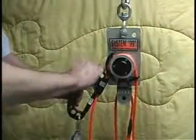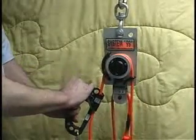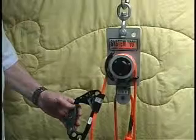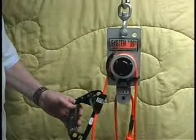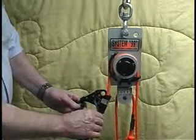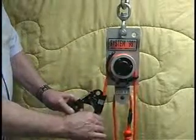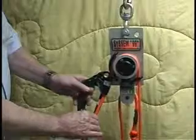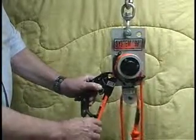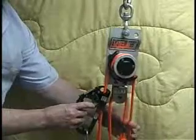When you want to lift the load, you put one hand in the handle body and one on top and you pull down. The handle gives you a grip for your lifting. To reposition the handle, you hold tension under the handle and slide it up, then pull down again. If you want the load to descend, you open the travel lever while still holding tension, then let the rope play through your left hand and it descends.